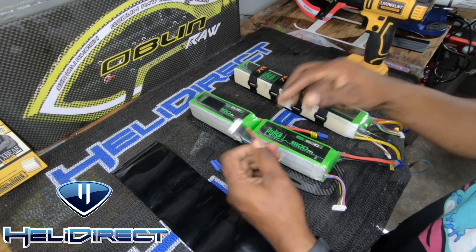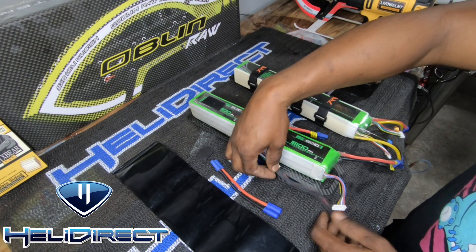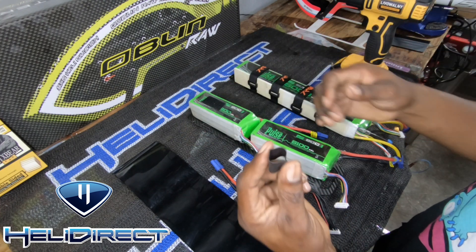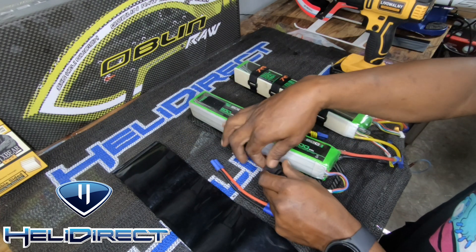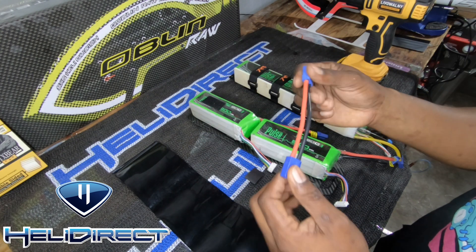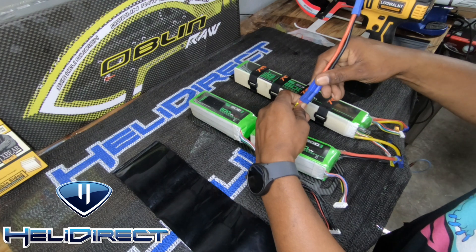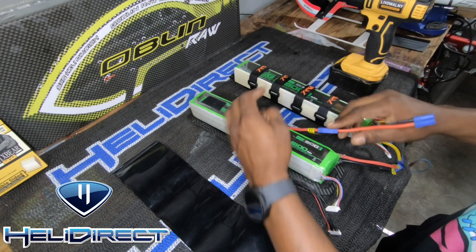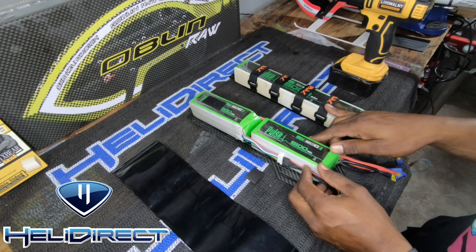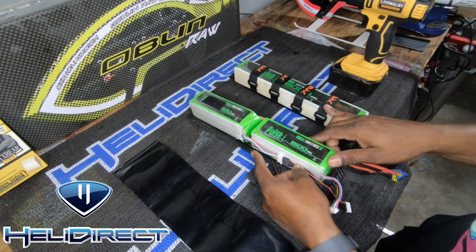What I'm going to be using today is a six-inch battery lead for a 6S battery and I'm going to connect it here. I'm also going to slide over a piece of heat shrink tubing to secure this. I've built up another six-inch battery connector that matches, so we're just going to have this here — it's easy to plug in and it won't come off because it's so tight once everything is lined up really nice and straight.